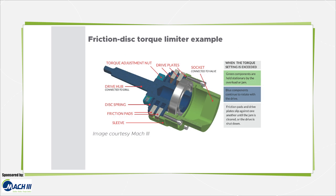Friction disc torque limiters use friction contact between mating discs to transmit power, working much like friction disc clutches in that overloads cause slipping between the discs. They excel in applications requiring continual running and moderate adherence to a safe torque setting. When mounted onto motor-driven machines, these torque limiters allow axes to power through partial jams using motor inertia to continue application of torque, preventing nuisance stops during momentary load increases. During true overloads and inertial shock loading, the torque limiter slips continuously to protect the system from damage.